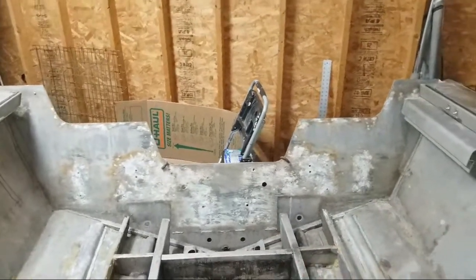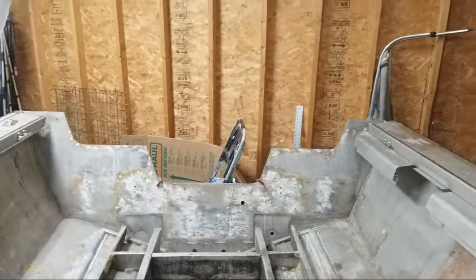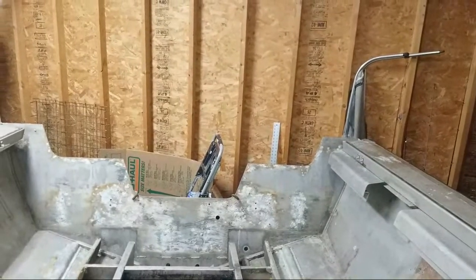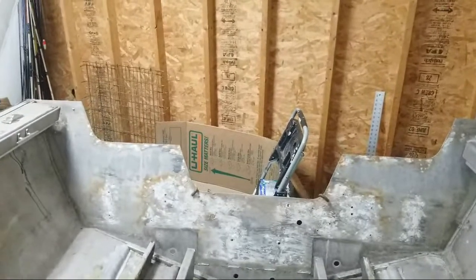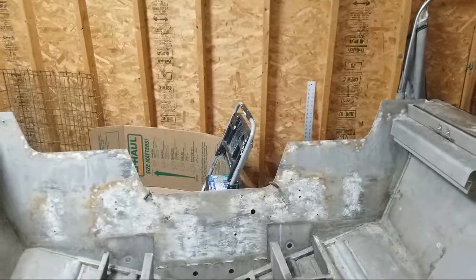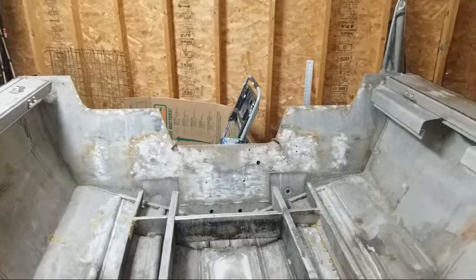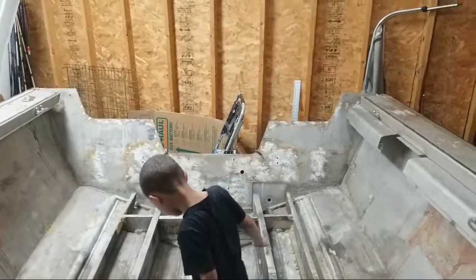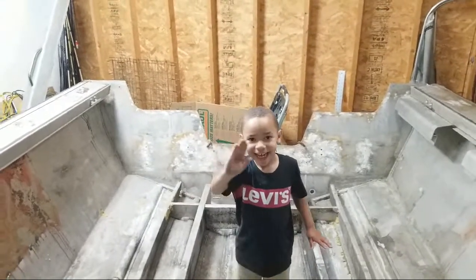And I'm going to look into powering it with a brand new Mercury Pro XS or the Yamaha Sho 200. And the reason I'm going to go with one of the 200s is because the blocks are identical to the 300. The Pro XS block on a 200 is identical. So I'm going to look and see what it takes to bump the power to 300 and run it with the 200 stickers. So everything will be technically 200, and I'm going to run it at 300 horse.